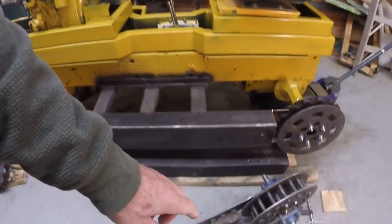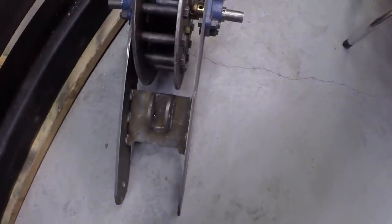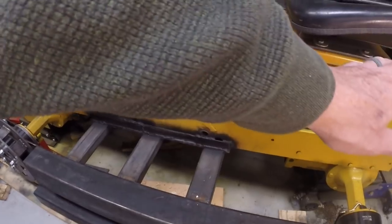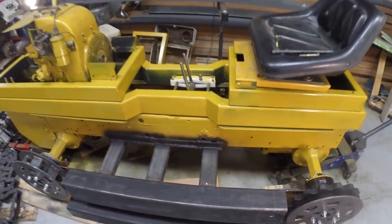All right, so we've got to the point where we finished the track tensioner wheel. Now this wheel mounts on the box beam here. This hole, which will be enlarged to 3/4 of an inch, will support the large pin going through here. This is a connection point for the track tensioner, and this whole wheel will pivot up here, up to tighten the track and down to loosen the track so it can be removed or replaced or serviced, and also to tension it